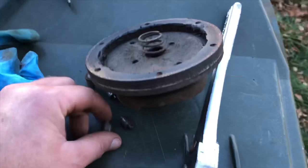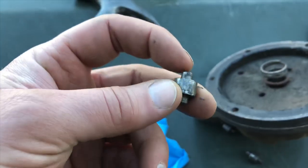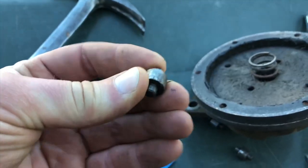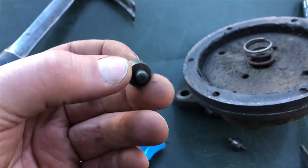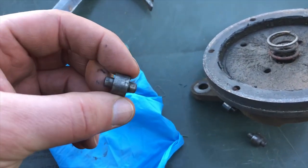The next part of this plow series is getting the clutch to work right on the 8163B. I just took it off — check out what we got. Our three little pieces that go on the clutch and they're all frozen. These are supposed to spin on these metal shafts, so we've got to take them apart and clean them up.